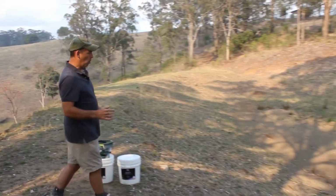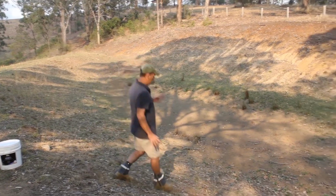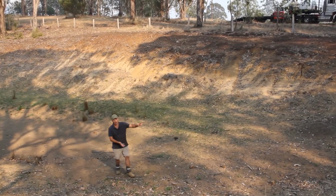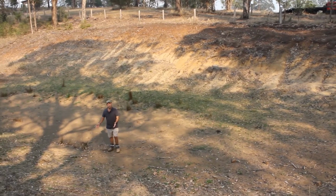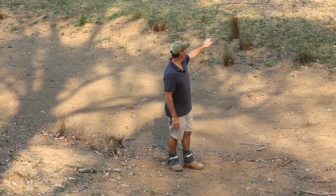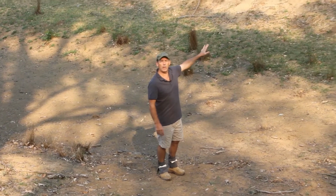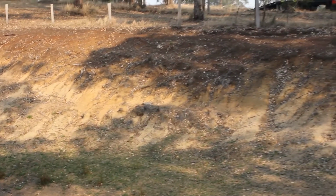So we're working with a contractor here. What we believe we can do to rectify this situation is actually take away a section of this dam. So this entire strip through here, which is likely to be where there's the most pressure when this dam is full, this is where the leaks are likely to be. Not back in natural ground there. You can see the colour of that clay. There's actual reasonable soil there, but that's not where the water pressure is at the top. The water pressure is down along this constructed wall.